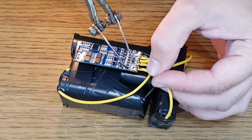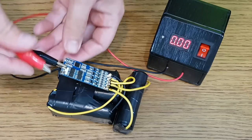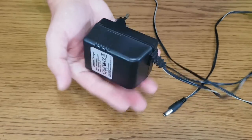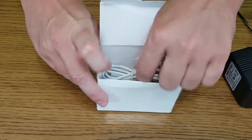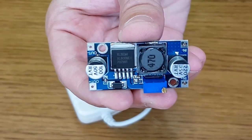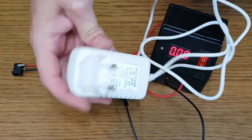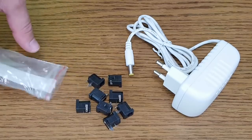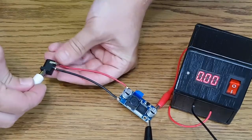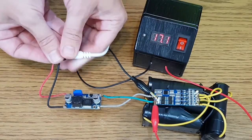I need to solder the balancing leads to the board, but it's not working the first time — you need to connect it to the charger first. The original NiCAD charger is very large and heavy, probably using an old power-hungry transformer. So I'll use a 12V 2A efficient charger combined with a 3A step-up converter. I got all components from banggood.com — purchase links are in the video description. I can also use the connector from the old charger. Next I need to increase the charging voltage from 12V to 18V, and then I can activate the protection board by connecting the charger for a few seconds.